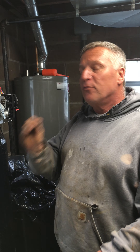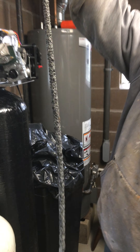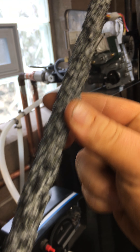So if you run into that problem, don't let somebody come out there and sell you a system for it. Nine times out of ten there's a rod that runs down the center of your hot water tank called an anode rod. When these rods go bad, they'll produce a rotten egg odor on just the hot water.